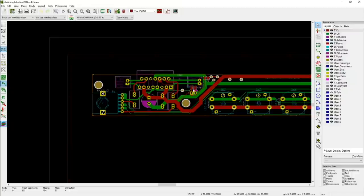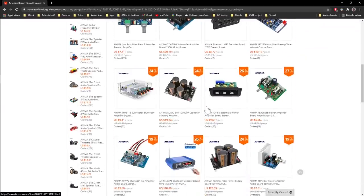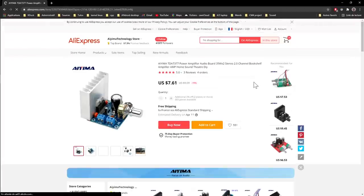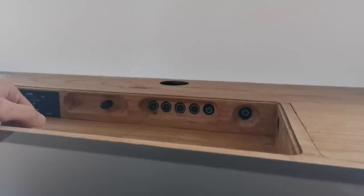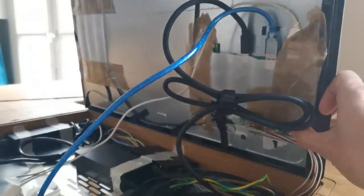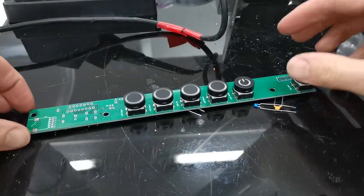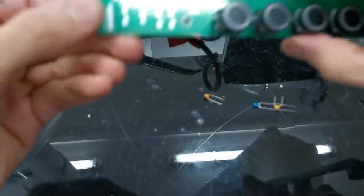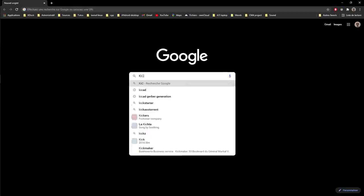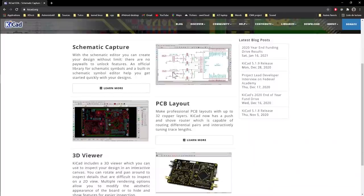3D design was not enough though — I also had to do PCB design. The speakers need an amplification PCB, and I couldn't find any which fit neatly into my enclosure. Also, the control buttons for the LCD needed to be accessible, and the stock buttons were just not usable for that. So I ended up making a whole custom PCB for those two functions. For that, I used KiCAD, which is also a free and open source design software — I'll leave the link in the description.